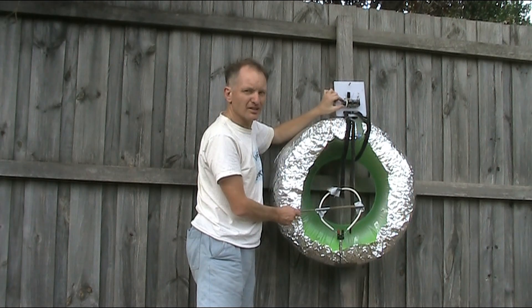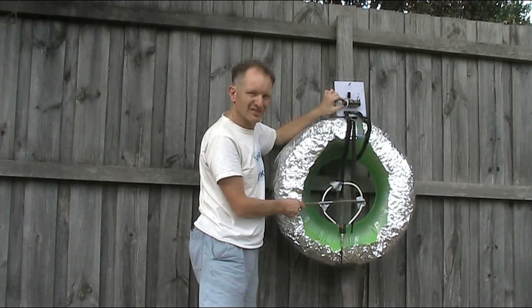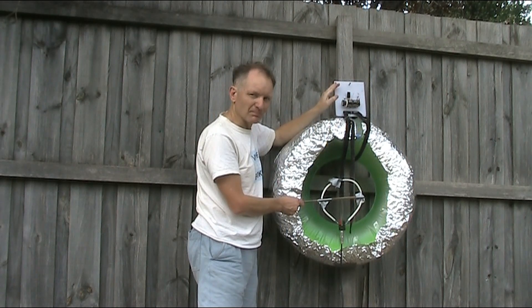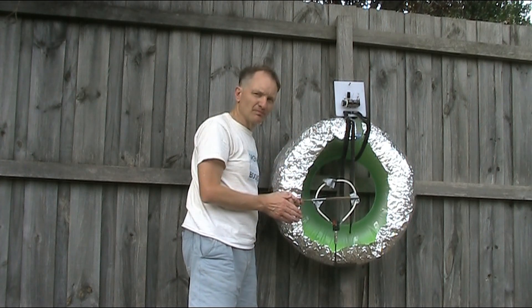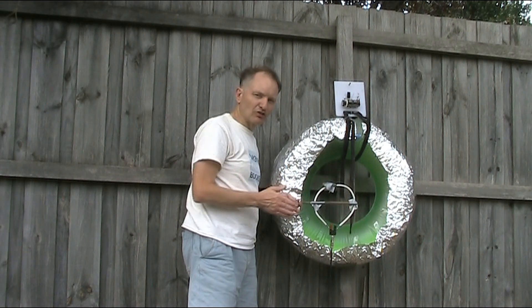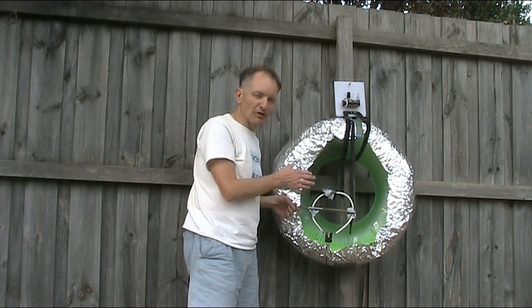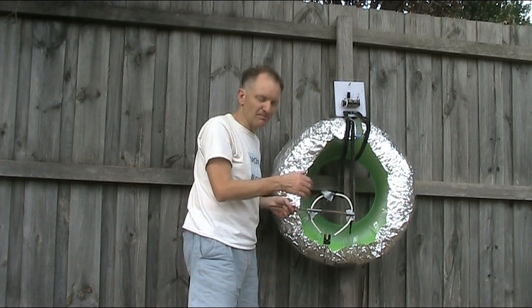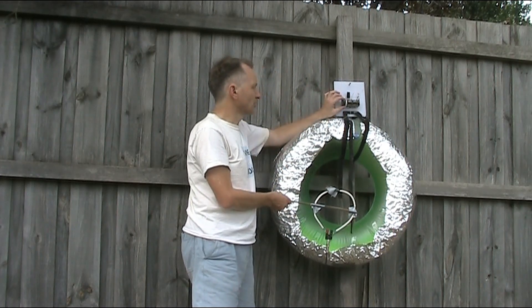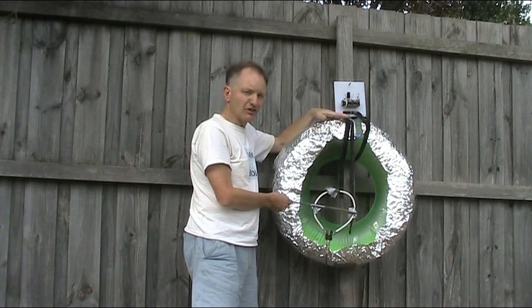But I'm not getting much resonance at 28 megahertz. There is, however, a peak at 21 megahertz, and you can even hear some FT8. But overall I'm not very happy with it — I think it should be a lot sharper. I did try transmitting on 14 megahertz and wasn't able to get the SWR down very much at all; it was still way too high. With these sorts of loops you should expect it to be very close to 1 to 1, very sharp null. So yeah, I think it's got potential, but this one isn't going to be working for me.